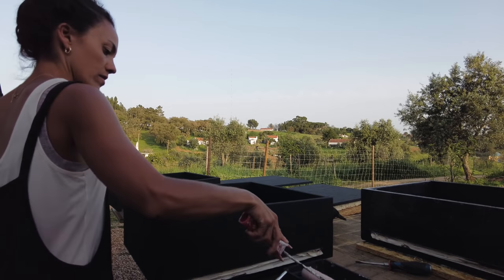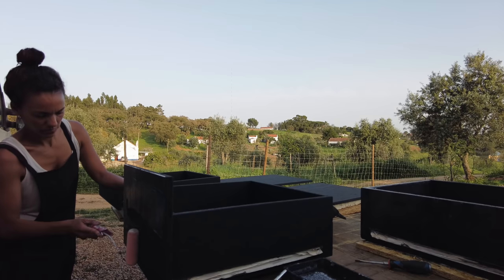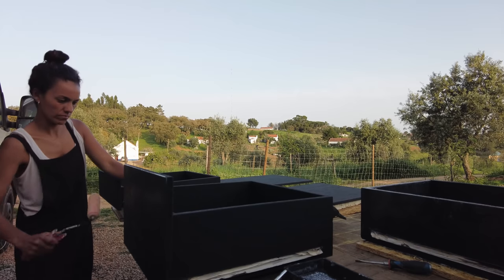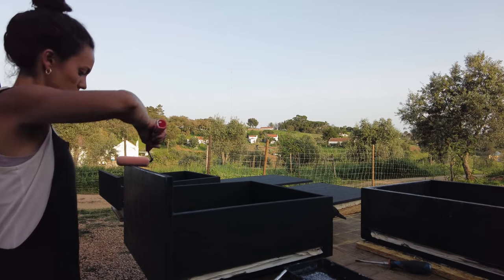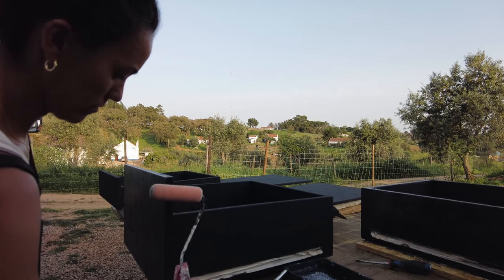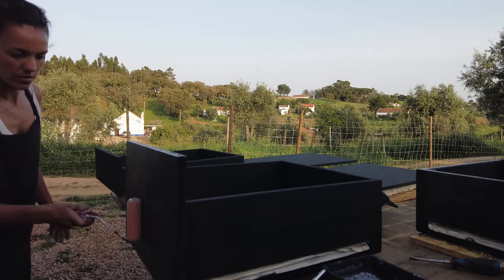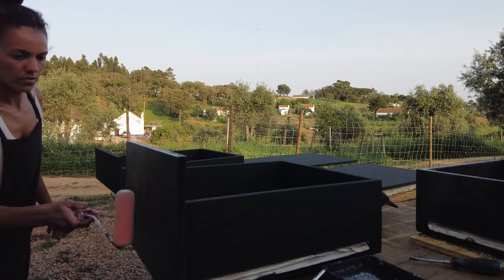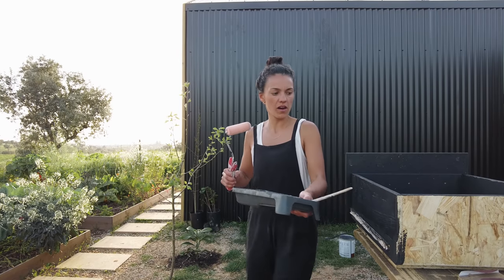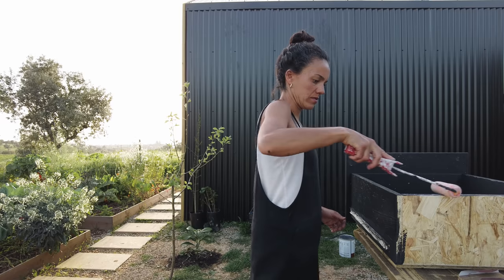After a couple of weeks working on the kitchen, we were able to finally start varnishing it. We ended up giving 2 coats of black paint and 2 coats of clear semi-gloss varnish. Same kind of finish that we gave to the kitchen in our camper van, that proved to be extremely durable and sturdy while living in it. We think that painting it black paid off in the end, and are very pleased with how it came out. The kitchen looks modern and well finished, even though the actual material cost was very low. Adding the final touches with the brass and black pulls was the cherry on top.